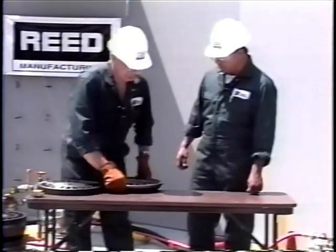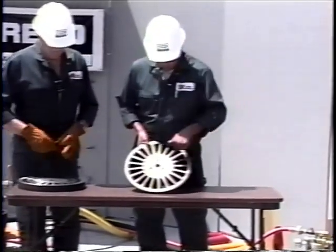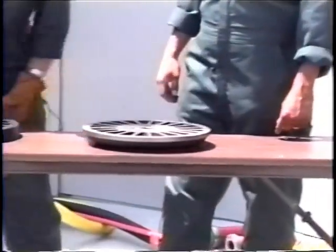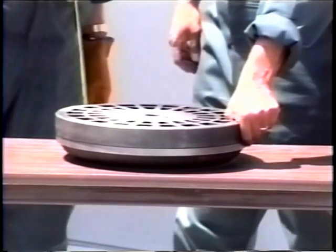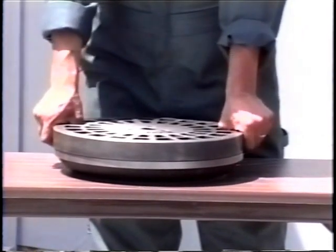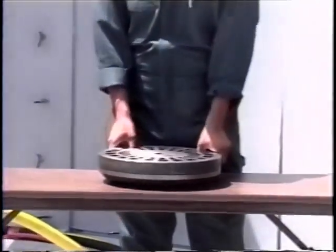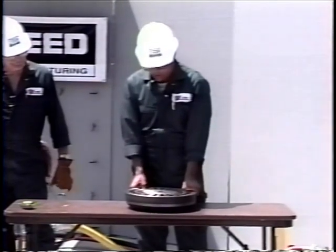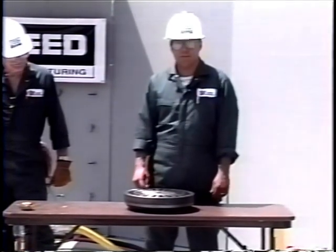Next is the 21-pocket, which is again dividerless — 21 pockets with the wear plate. It's a two-inch thick bowl with the wear plate, three and a half inches deep. This is still a very low-application, low-volume spraying setup: two to four cubic yards per hour with a very even, smooth pace of material flow. Air consumption comes up a little more, from 250 CFM up to 450 CFM.